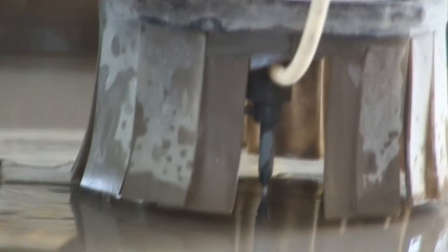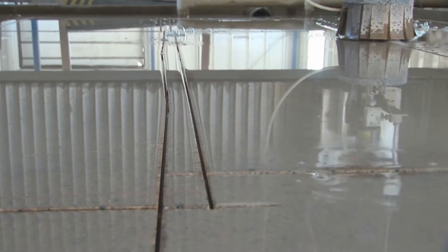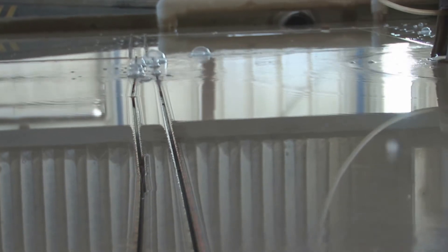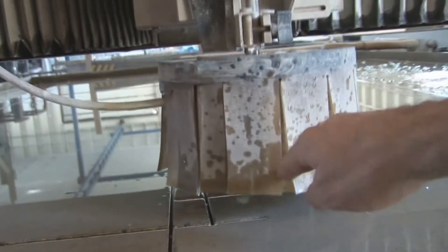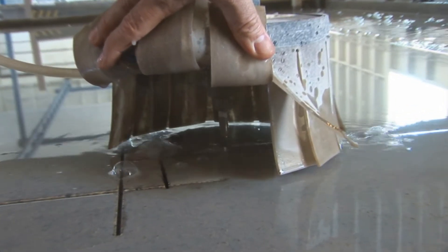Now you can see where it's going to go back along the backside and scribe this wall. In this shot right here, you can actually see where the saw has come down and plunged in a series of straight lines. The water jet's now going to come in and clean up all that and connect the dots. And that's where you can actually see the bow that's in these people's wall of their house. The saw knows exactly how far to go without hitting the adjacent piece, and the water jet's going to come in and punch just as much as necessary to remove the curve from the blade.